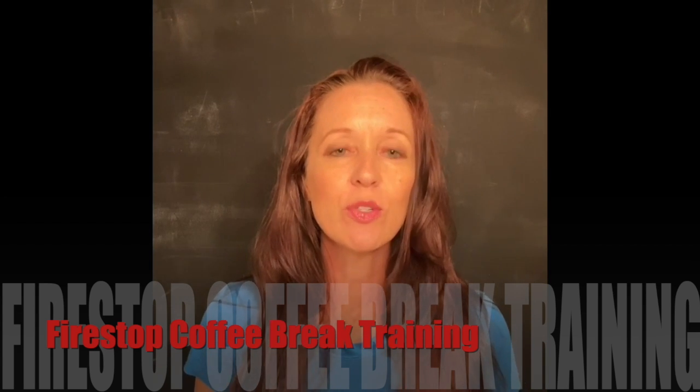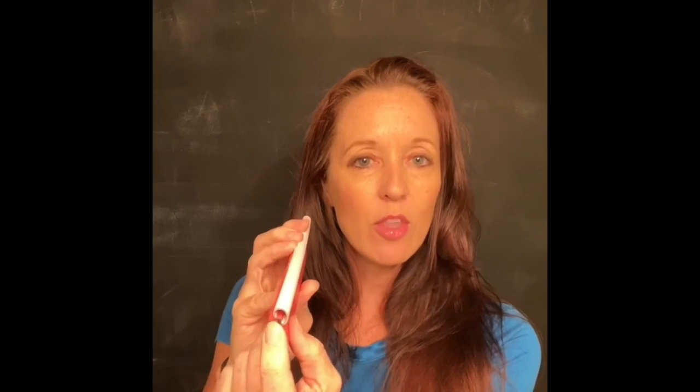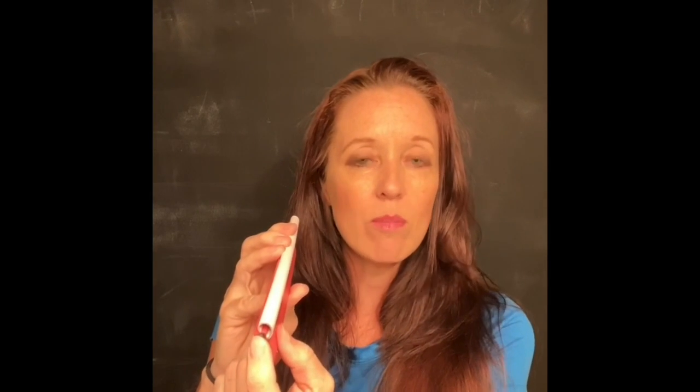This video is going to introduce you to a product called the Fire Gasket and give you all the information you need to ensure that your installations are code compliant. You'll see that this product is a little bit different from the other devices you've seen so far. Similar to the Firebeat, it has this 3/8 inch white bubble gasket that will create a permanent seal against the concrete deck that will protect against both smoke and sound passage as required by some sections of the building code